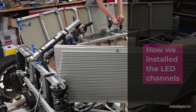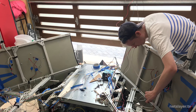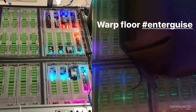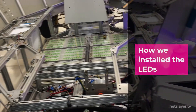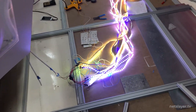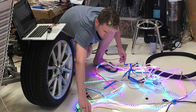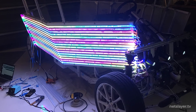Now it's time to install those LED channels. The aluminum channels holding the LEDs were installed into all the panels around the car and bolted in with help from some amazing friends. Then the Teensy Arduinos were wired in as light controllers, the warp floor got wired up, and it looked amazing. It took a bit of time to configure the light control scripts with offset and zigzag configurations. Each saucer panel was wired with 600 LED pixels, and with the roof on it'll have over 6,000 pixels all around. Each LED strip was wired to a power connector going to the step-downs and a data line to the light controller, with power injected once again at each row's loop back.